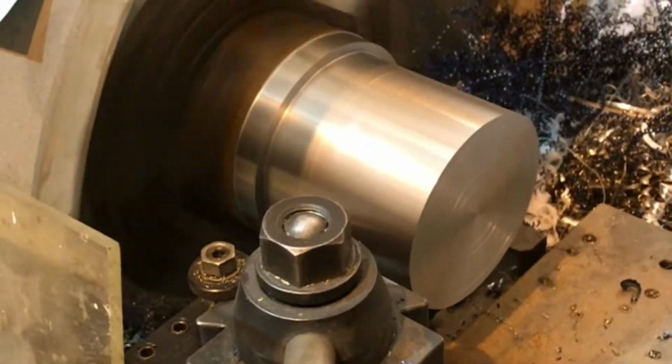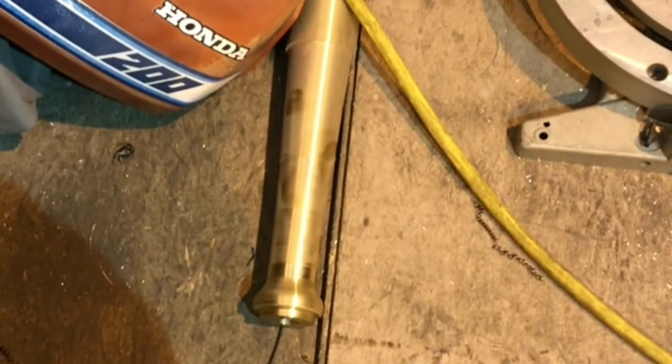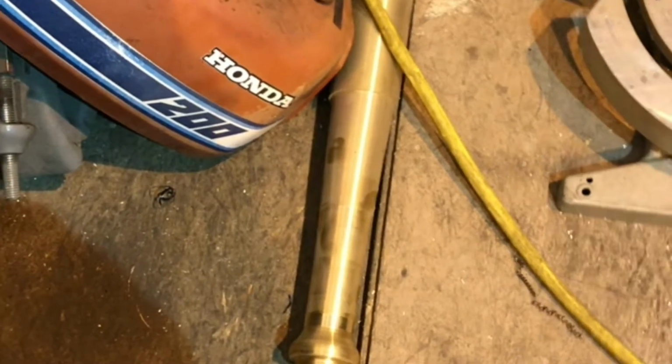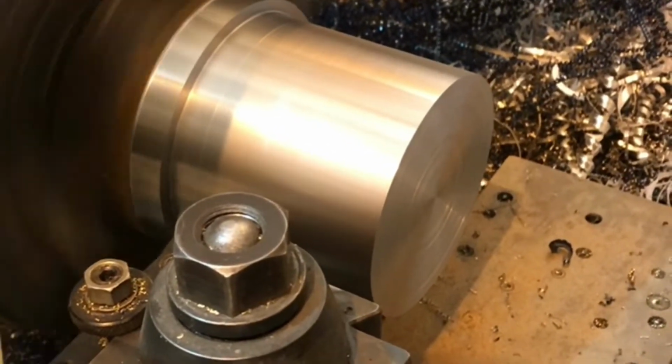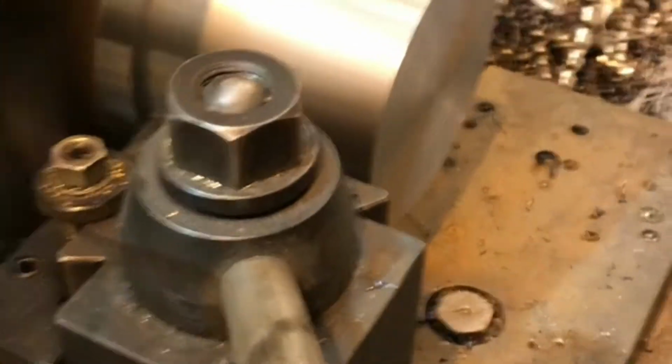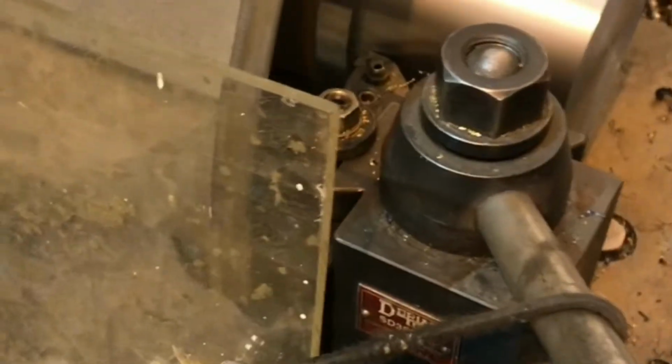Yeah, I blew the VFD in the other one, so I had to swap it over to this lathe, which meant, unfortunately, I had to take the cannon out. No big deal, I can get it lined back up, but one of them things. Popped the VFD, I tried to fix it, didn't work, so I got a new one coming that's 1 more horsepower bigger, which is oddly a very big VFD compared to what it was.